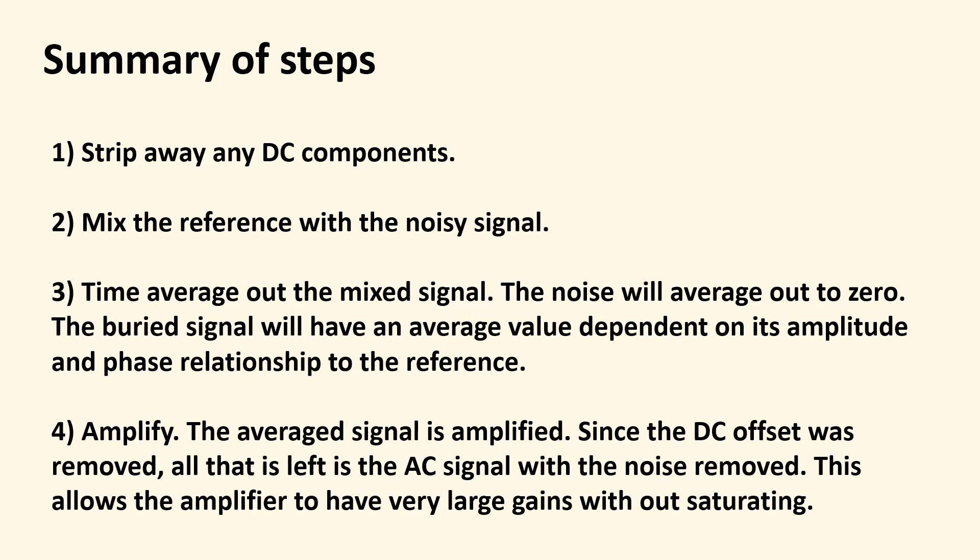This is extremely effective. If you have a very low-level DC signal, it makes sense to use an optical chopper or similar device to modulate it into an AC signal. Yes, you throw away some signal — at least a factor of four total — but your noise is crushed down much, much lower than your signal. Thus your signal-to-noise ratio is greatly improved, making lock-in amplifiers a fantastic tool and the technique of modulating with a reference signal a fantastic method to detect very low-level signals. Thanks for watching.